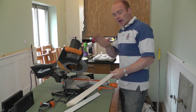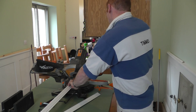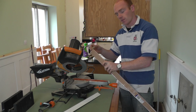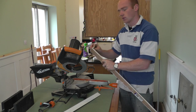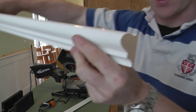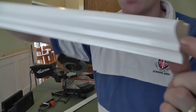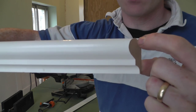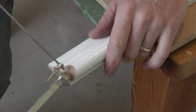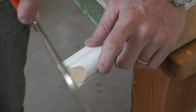What I'm going to do is cut a compound angle — just take 45 degrees off the end. You can make sure you've got 45 degrees by flipping the piece over and holding it up to just make sure that it is a right angle. So what you then create, when you look at it square on, you've got the side profile. What you see here is that the core of the MDF is the exact same as an end profile, and basically that gives us the line that we can use our coping saw along. So we'll clamp this down to the workbench. Here's the cut end where we've cut that 45-degree cross-section through the moulding, and what we want to do is just keep our blade vertical and cut away that pattern.